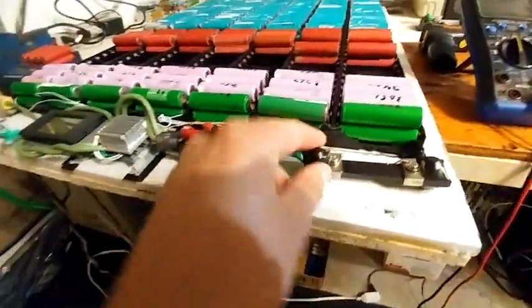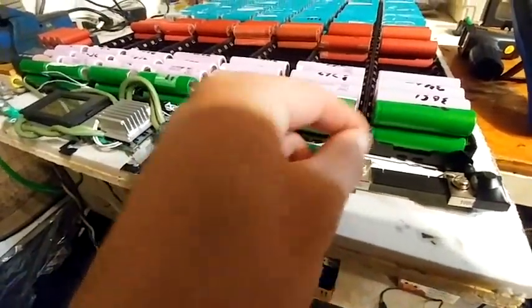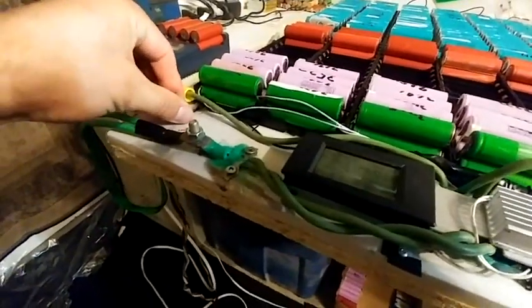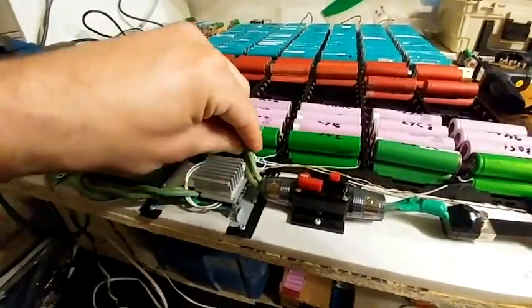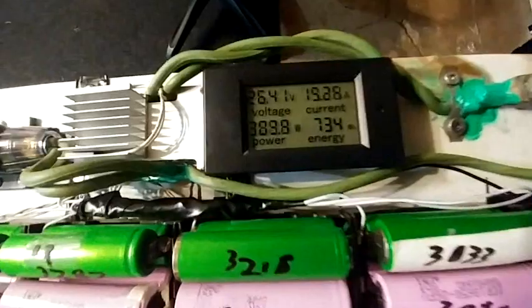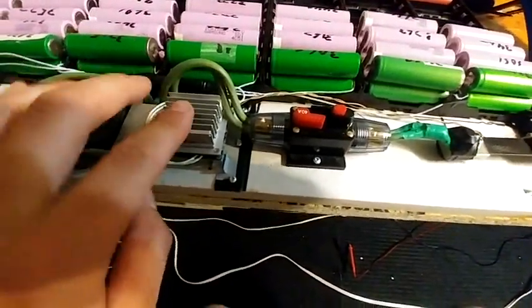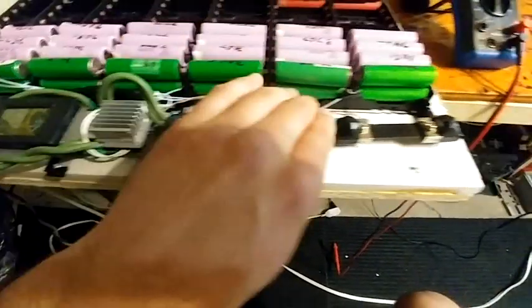It's warm right here, so I'm going to put some dielectric grease. It's pretty easy because it's a nut and bolt — I'll just take off the electrical tape, loosen it, take it off, and put some dielectric grease on there. Everything else is cold, so you know there's a problem. Cold, cold, cold, slightly warm, pretty warm, cold. It's 11:30, so it's been an hour now. This heat sink is a little warm surprisingly, but I think it's because it's touching these wires and absorbing a tiny bit of that heat.